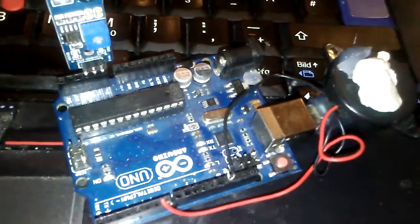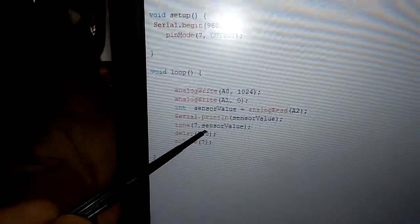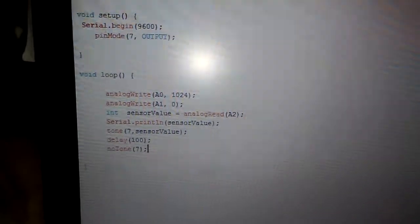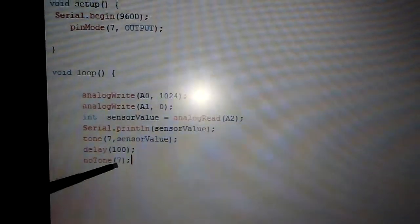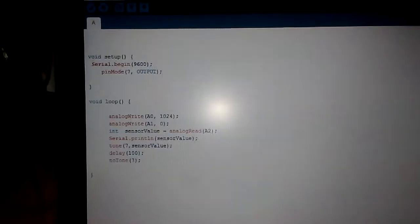It is a bubble gum attached here for less noise. I can divide this amount by 2 or 3 when I want low noise, or I can use the multiple with the numbers to adjust the best sound coming to the buzzer. Very well. And finally, after 100 milliseconds, I will shut down the tone to feel exactly what's going on.